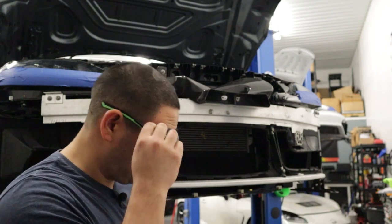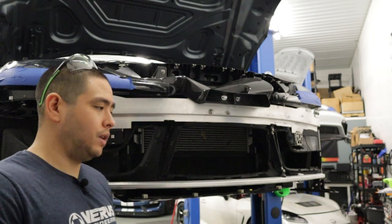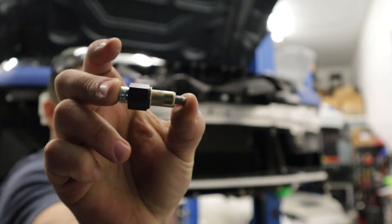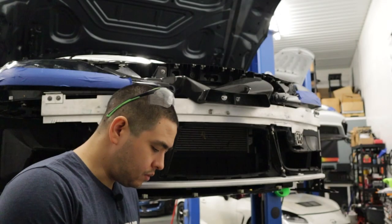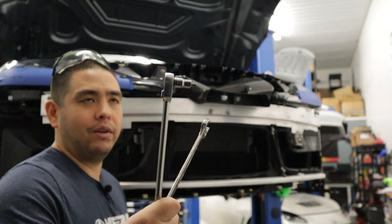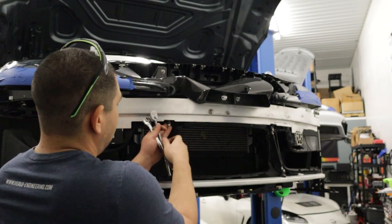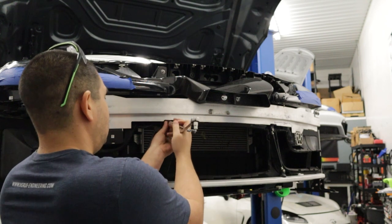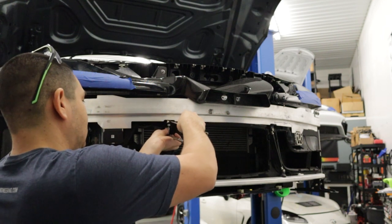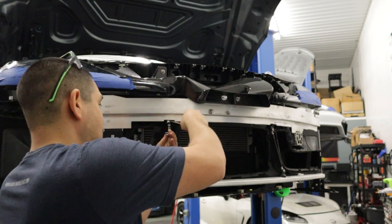I know this is probably the wrong tool — it's definitely the wrong tool — but it's a throwaway step bit. Hole's drilled to three-eighths of an inch. Now we're going to grab our rivet nut and rivet nut installer tool and assemble it. Next thing we need is our 9/16 wrench and ratchet, plus a five-millimeter Allen. I'm going to stick that up into the hole we just drilled, and we're going to hold back the hex portion or nut portion of the install tool, and then begin tightening the Allen bolt.